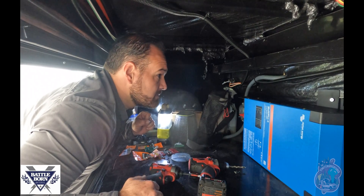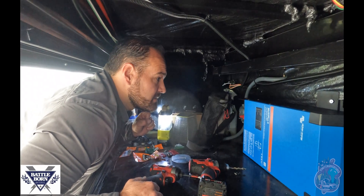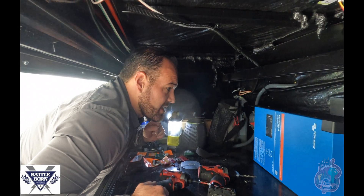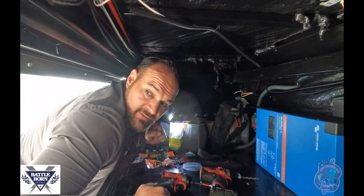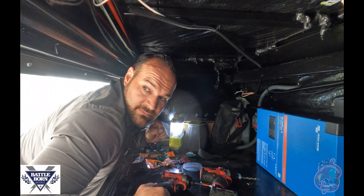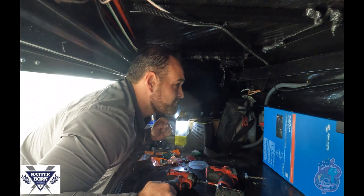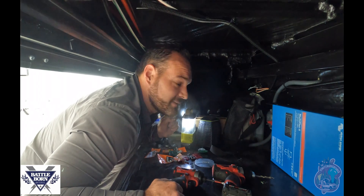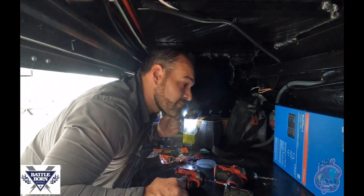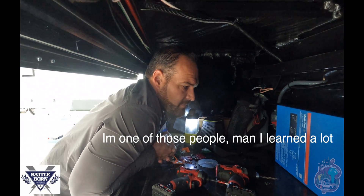So I can actually turn my TV on without having to run my generator? Yes. That's the most exciting part for me. And with soft starts in your AC, you can actually run one AC unit off of this as well. These only pull just a little over 10 amps, so you can probably do two. I'll be able to get away with two — and you've got enough battery for it. So 810 amp hours — what's that relate to for the people out there that we're educating today?